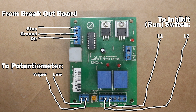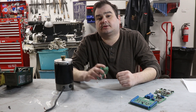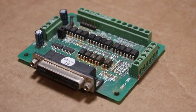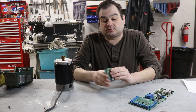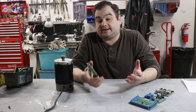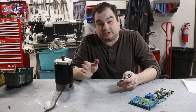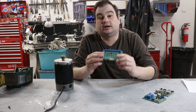It's worthy of note that this board also requires its own separate 12-volt power source, separate from the 5-volt that you run the breakout board with. If you're really budget-oriented or maybe just don't have experience with other technology, these DB25 breakout boards that seem to come free with a lot of stepper motor kits and other imported sources — they're free, and I definitely used one for a while. One thing to be aware of is that these do not put out a very clean signal in their logic, which can actually affect all of your motion across the entire board — everything going in and out of the PC to the machine. So while these are fun just to get your footing, it's actually pretty wise to upgrade to a better breakout board.